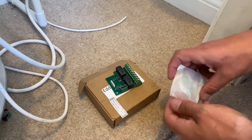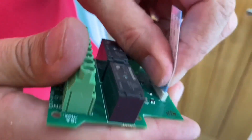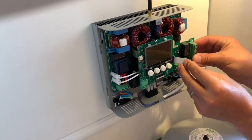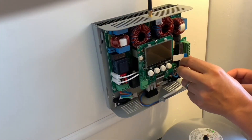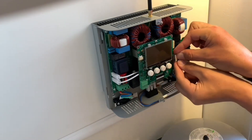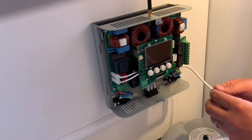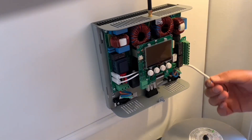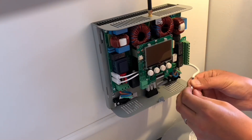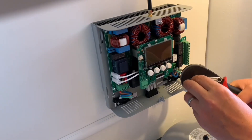We're looking for a little ribbon cable and some PCB spacers inside the box. The spacers clip into the motherboard of the Eddie, and then we insert the ribbon cable into the slot just to the side of the LCD screen. That seemed easy — and there's no other commissioning needed; the unit will automatically recognise it has a relay card fitted. For the wiring connections, I'd suggest using a ferrule crimping tool since it's fine-strand conductor, just in case we ever need to remove it.